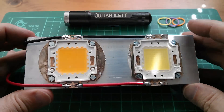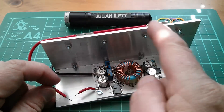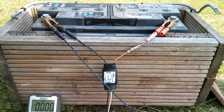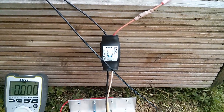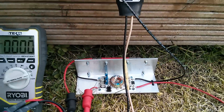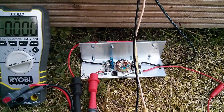The two 100 watt LEDs are now wired in parallel. Both positives join together and they're wired down to the output of the driver. I'll put banana plugs on the wires for the battery terminals outside. So I'm outside now with the big 12 volt car battery, which is permanently being charged with one of my charge controllers. The LED module is here with the LEDs facing away so as not to dazzle me or the camera. I've got the ammeter in circuit. This is still set for three amps, so let's try this.